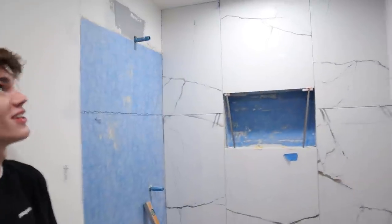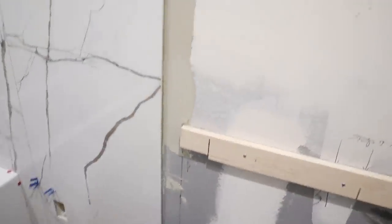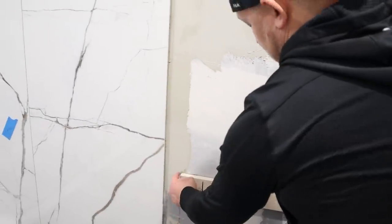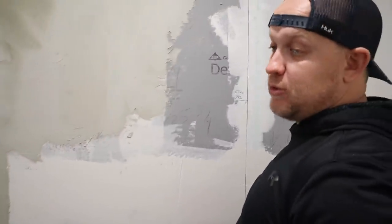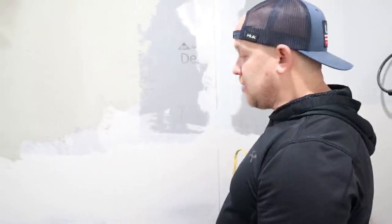I can tile. We got this whole back wall done today, and then half of this wall — almost over to where the vanity will meet up with it. Right here on this end — that's what this piece of wood is for. So this is the edge of the vanity, and the tile is going to come to here and set up on top. I've never done it this way, but I'm trying to save the tile guys from coming back. I'm going to have them just set to this piece of wood, then put my cabinet in and slide my countertop underneath it. Everything's got to be perfect. I'll have to cut the corner of the countertop to fit around the tile, but I can make that happen.